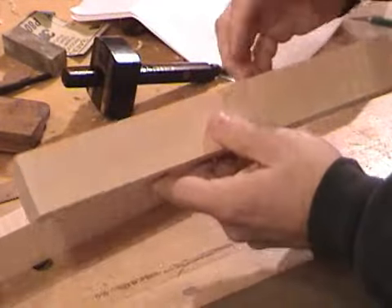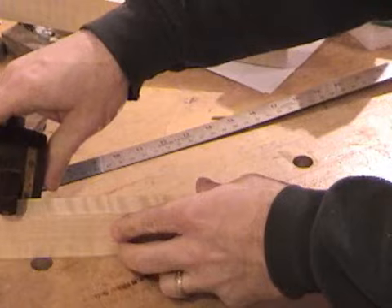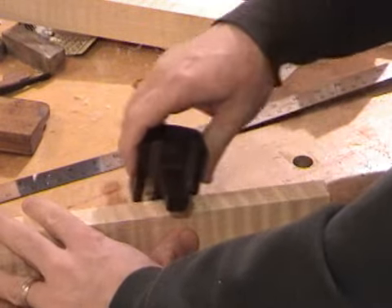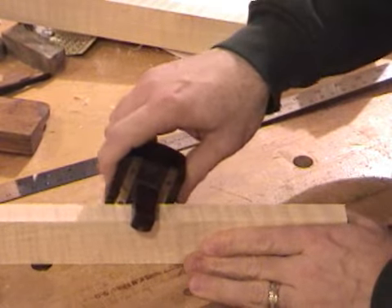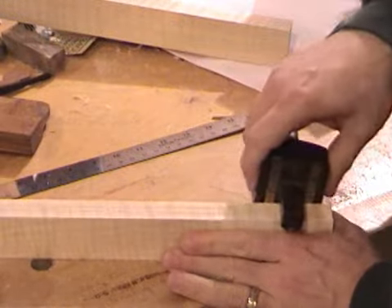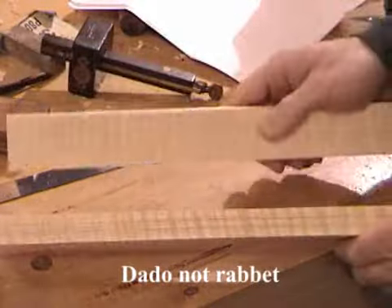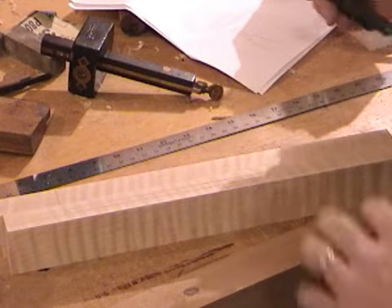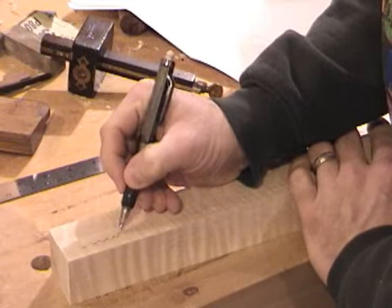If you've labeled the top or the inside edge, you can also, while you're at it, just continue this mortise layout. Remember to keep the face of the wood consistent — the outside face. So you can do this, and now you know right where the rabbet for the panel needs to be. We'll do that on both ends. So that's pretty much it for layout. Now, just so there's no mistake, go ahead and put some marks here to know where your mortise is going to be.